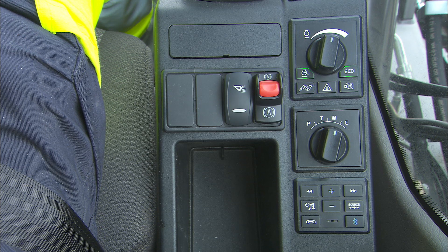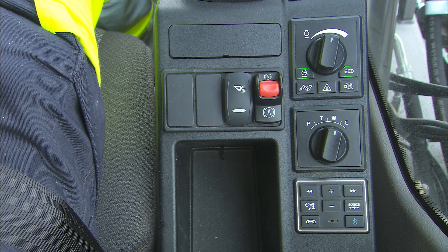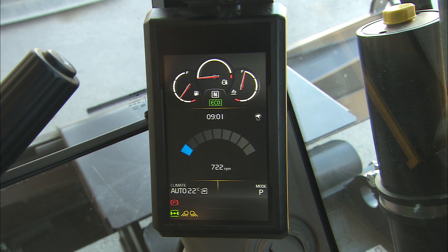In addition, some switches for optional equipment like radio remote, the new boom suspension system, and electric digging brake may be found on the right console as well. A hands-free Bluetooth connection for a cell phone is also available. The monitor provides detailed machine information like indication lights, coolant temperature, fuel and AdBlue DEF level, engine RPM, climate control information and more.